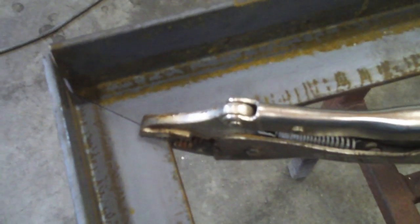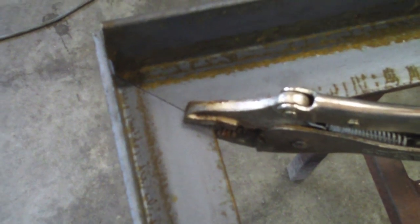Here's a picture of the corner where I 45'd it. I've just got it held in place with a vise grip. What I've got going here — see that gap right there? When I did the 45, I did not cut this face; I only cut the long face at 45. What that leaves me is a really nice corner weld. Look at the size of weld I'll be able to put in there. That also adjusts the dimension just a hair — the width of the iron, which is 3/16ths. I'm going to show you where that will come in handy.